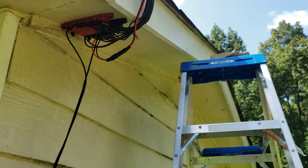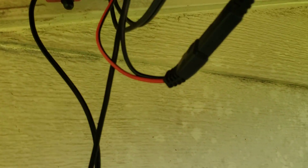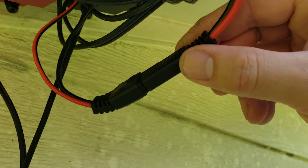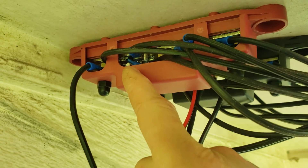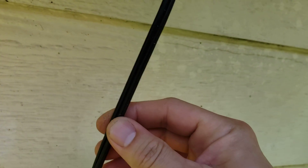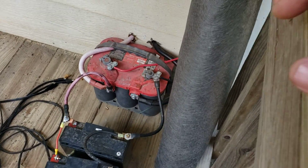The way I did it was to have all the leads coming into two terminal blocks off the solar panels. They come from underneath and all my leads come down — I clipped the SAE plugs off, leaving the one on the new solar panel so I can move it, and put pigtails and terminals and used a bus bar system. The bus bar brings just a single positive and negative down into the charge controller inside the little house.